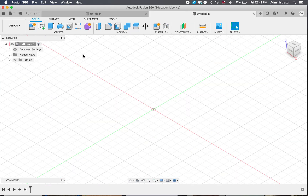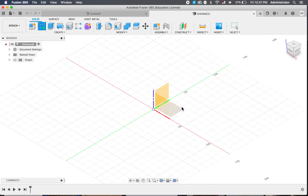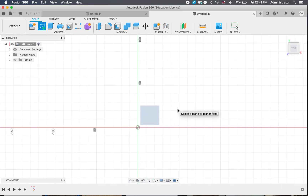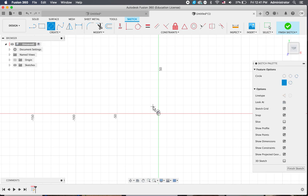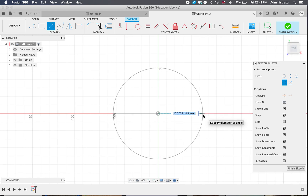In your new tab, go to create a sketch and put it down on the bottom. We're going to do everything we build on this from the centre of the page outwards. Over time you'll realise why we do that. So start off with a centre diameter circle, click on the centre and come across.